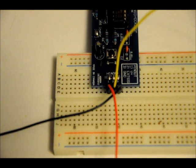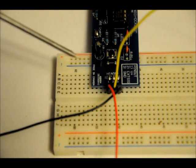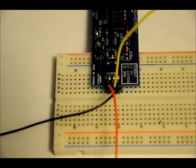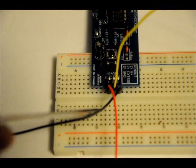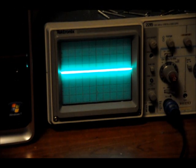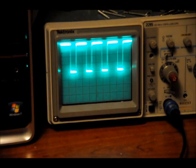It fits nicely into a breadboard, and would also fit well into a printed circuit board if you wanted to add it to another circuit. It also fits well into Arduino shields. Pin 1 is connected to V+, which in this case is 5 volts — you can connect it to 9 volts or even 12 volts. Pin 3 is connected to ground. Pin 2 is our test signal, showing us what's actually going on with the ultrasonic transducer. I'm going to hook up my oscilloscope to it. With power applied, every time I press the transmit button — 40 kHz.